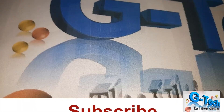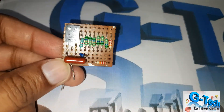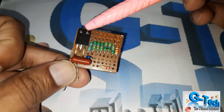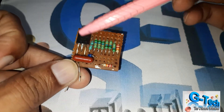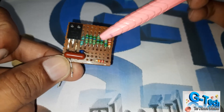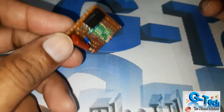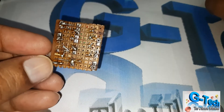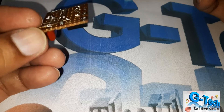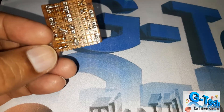Let me show you a simple electronic regulator circuit today. It is very, very simple. I am using one BT134 triac, one ceramic capacitor, one DB3, and a few resistors. Just look carefully — I am using a few components and I am making a fan regulator.